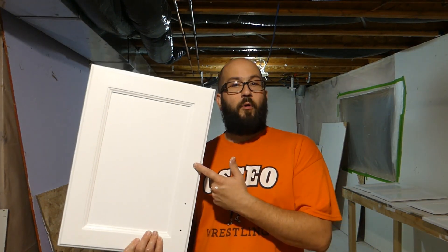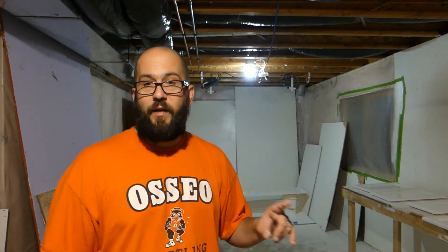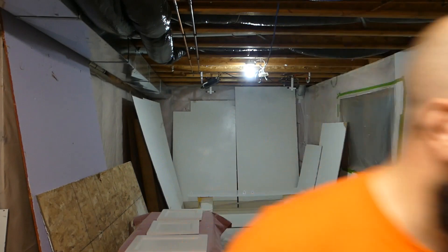That's where I'm at right now — I just sanded the front, the backs are done, the fronts need one more coat of paint, coat number three, and then they'll be done. I have 42 doors and drawer fronts to do and it takes about two hours to paint them all. I've been doing two at a time for this last stage but I'm just going to do one at a time now. I spray it, carry it, put it on. I'll also take a microfiber cloth and wipe each one down on the way over, so hopefully I don't end up with any dust nibs in the finish. I'll have a fan going pulling air outside, keeping any dust and overspray from getting into the finish. It's 1:15 in the morning — I should get going.